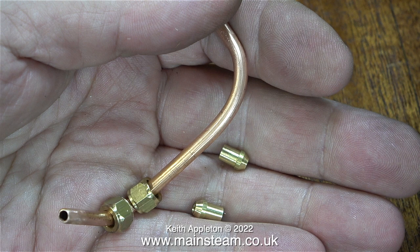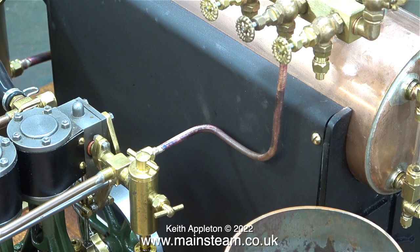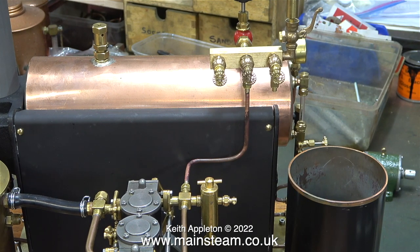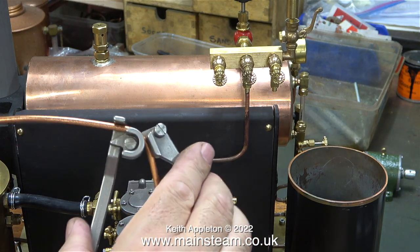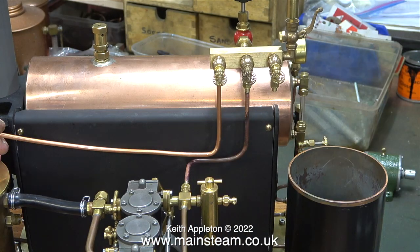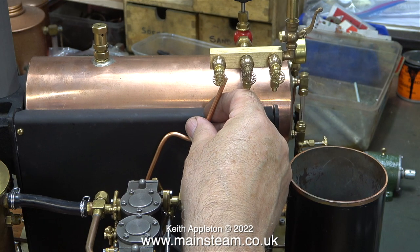Here's a finished kit of parts ready for silver soldering — can you spot the deliberate mistake? After the silver soldering operation, once it had fully cooled and been quenched in water, I fitted the pipe from the tap to the steam engine — that was the easy part. Now it's time to bend a really long pipe from the steam tap all the way to the steam inlet of the S50.